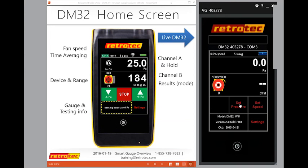So positive things can cause things to leak or move out. And so if you have to do positive, you should still start with a negative, just so you know that you have this number. Like, oh, my smallest number is this. And then if you do a positive test and it gets any larger, like significantly, you just actually opened up one of your registers from your duct mask.